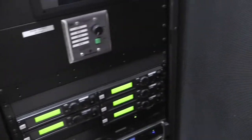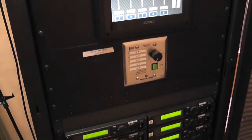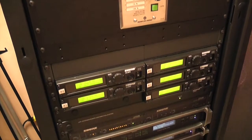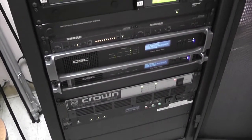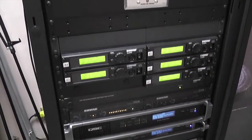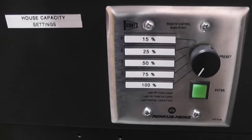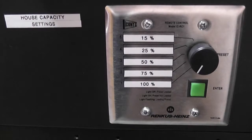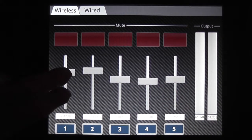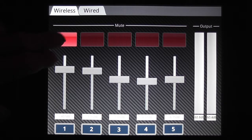The audiovisual system consists of a new AV rack in the sacristy. This rack includes touch panel control, house capacity settings, wireless microphone receivers, and audio processing. The house capacity setting switch allows you to adjust the speakers to the number of attendees within the sanctuary. The touch panel allows the user to adjust volume and mute various microphone inputs throughout the system.